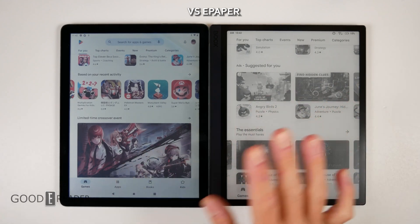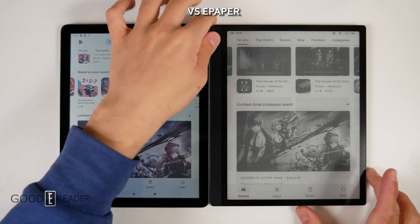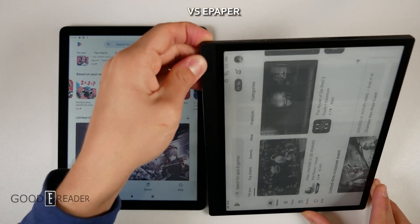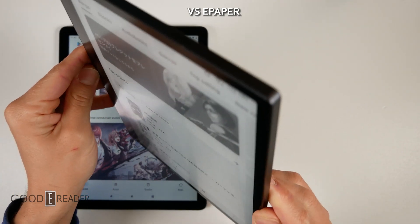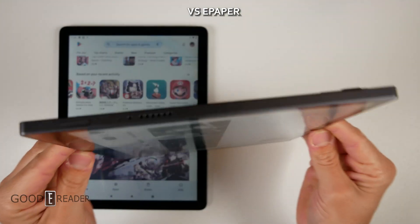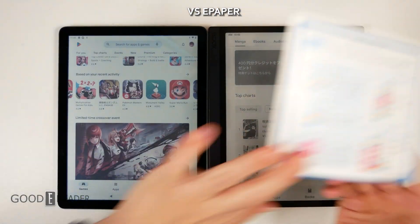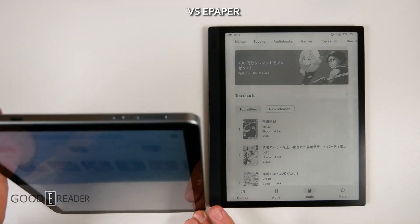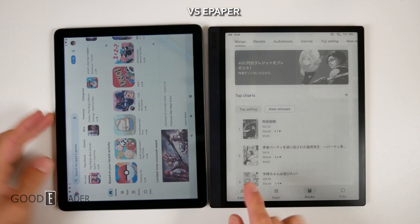It pings the Wi-Fi, and if you have both of these with Wi-Fi off on a static photo, the e-paper will last till the dinosaurs come back. This one will die in a couple of days. In terms of viewing angle, the e-paper is going to be wildly better because it usually employs some sort of matte properties. Even at an absolutely extreme angle, you can see the e-paper device as clear as ever. At any angle, e-paper has almost the same viewing experience as a piece of paper — because it effectively is. Whereas the RLCD is extremely hindered by the way you hold it.